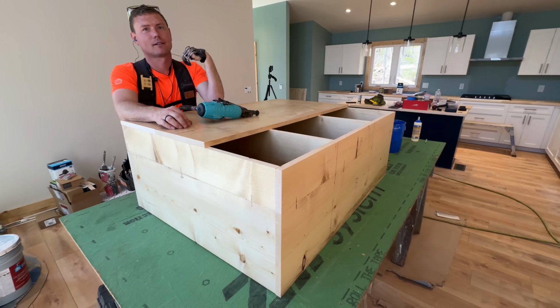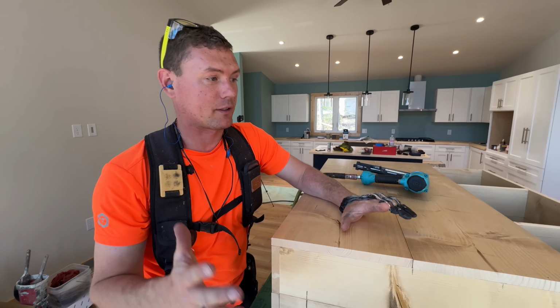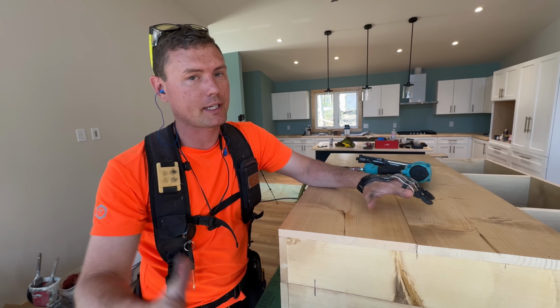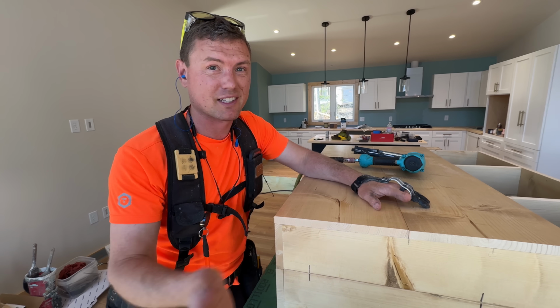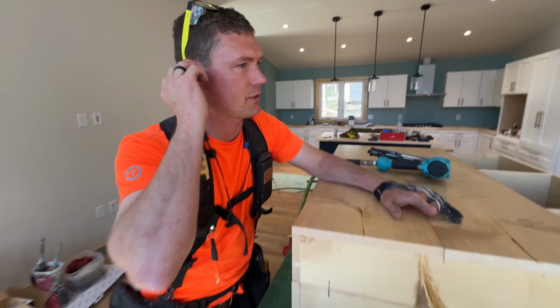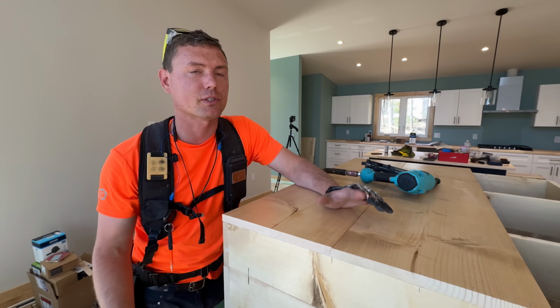So I got to ask you, why didn't you use plywood on this since you got to make it deeper than a board? Well, besides not being able to get some quickly and easily because nobody around here carries high quality cabinet grade plywood, I thought about it and I was like, sometimes plywood stains funny. You ever stain plywood? Yeah, it's blotchy sometimes. You never know what you're going to get. So in order to make sure that this looked as high quality as possible and matching the color and appearance of all the rest of the trim, I just used the same material. Exactly like the trim.